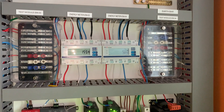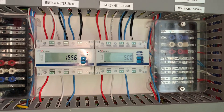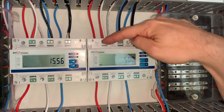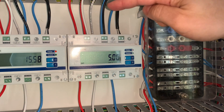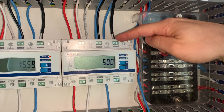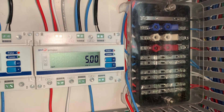Hey guys, we're here to talk about the new watt-hour meter that we're using. Firstly, we're talking about the wiring. You can see the green terminals — the top is reference voltage, phase 1, 2 and 3 neutral, and then this right-hand green terminal is the pulse output. So that's how it gets wired.